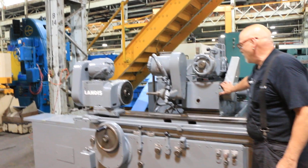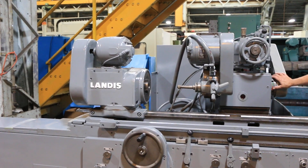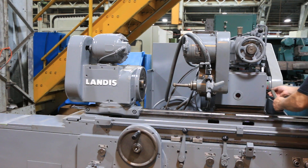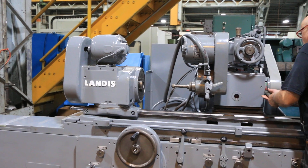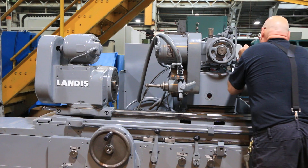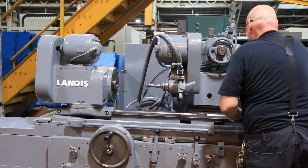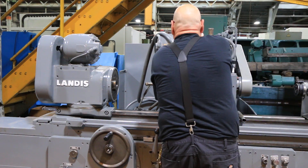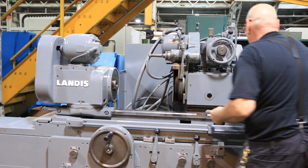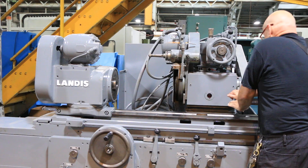This is a locking collar on the right side of the spindle housing. You want to have the spindle shut off before you loosen this clamp. You can see a couple of arrows here — red and green. Green would be to open it. This will swing up out of the way, and then you want to lock it down again — just like that.